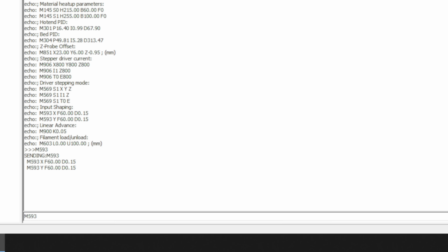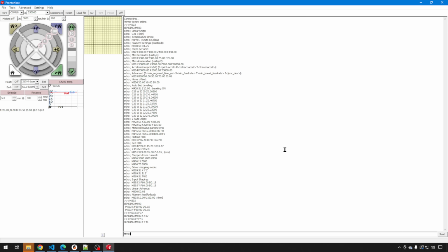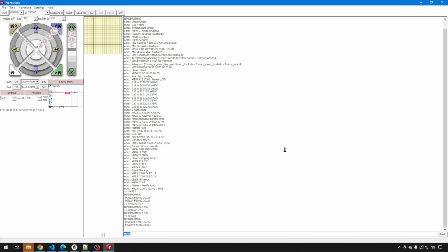So we'll just do M593 X F37, and then M593 Y F41. M593, to look at it again, our updates have been made.